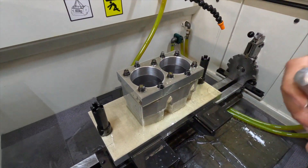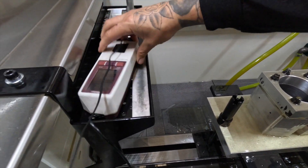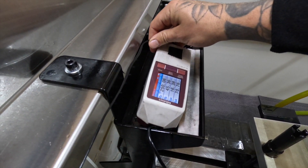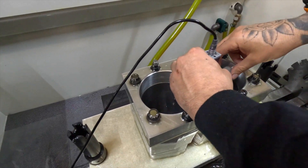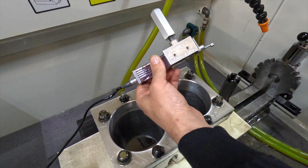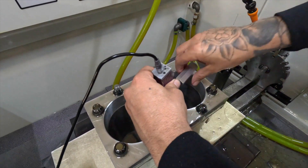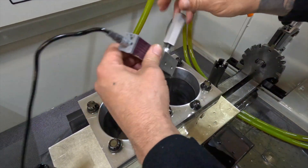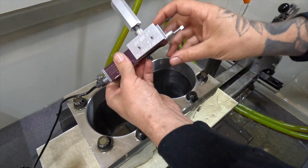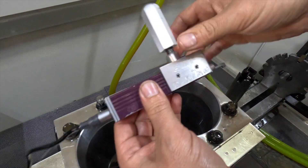This is our profilometer. This is not a camera that reads crosshatch — this reads surface finish. This little tiny stylus here — Brad at QMP makes this little holder for it. He's the same guy who makes the measuring center we use. Very clever.